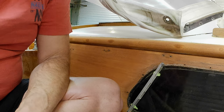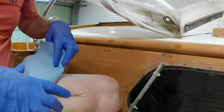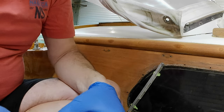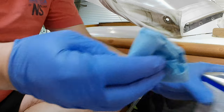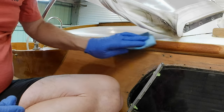Then I'll put down some masking tape and we can start doing some varnish. I'm using these blue rags — I know there are better choices, but this is what I have and it seems to work acceptably well. I do get a little bit of lint but it's not the end of the world. Some denatured alcohol on the rag — I'm using gloves of course — and just basically wiping down the wood.